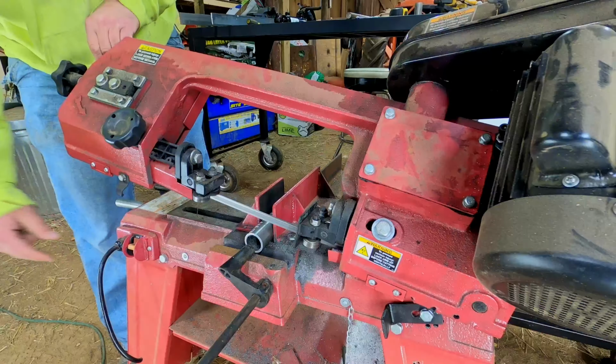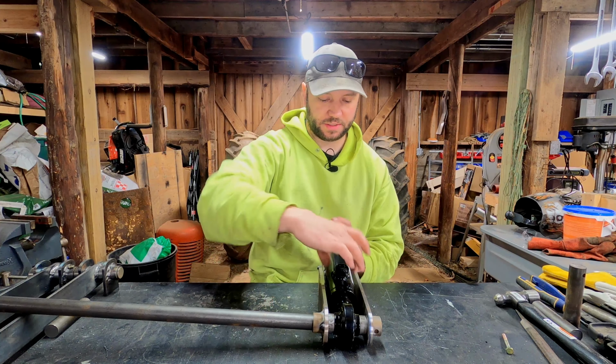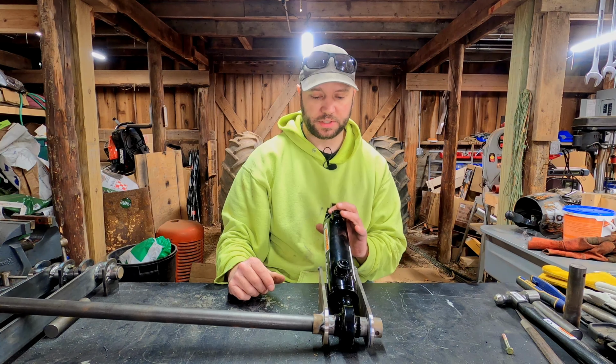So I like the way this looks with those 1/2 inch spacers in there. The cylinder fits down nice, and there's a little bit of room in between. The only concern I have is how much play I'm going to have in my pin and sleeve down here on this end. Am I going to be rocking this cylinder back and forth and actually coming in contact with these supports as things wiggle around? I really don't want to go too wide. I like the thinner look. So I think what we'll do is take these two supports, get them mocked up on the bucket the way it is, and start building the other side here. And then once we get that pinned together, we can see how much play there is and see if we need to widen this, because we can always take this back off the bucket and make it wider if we need to.